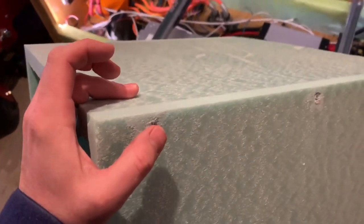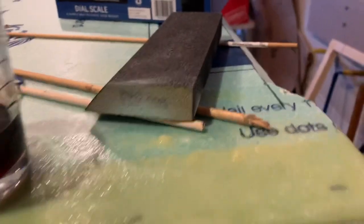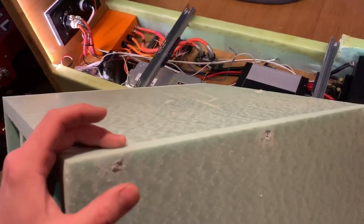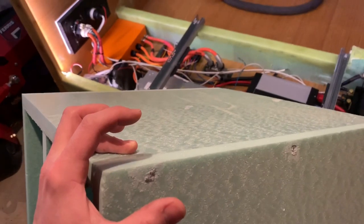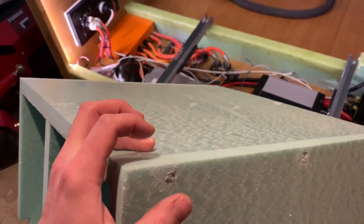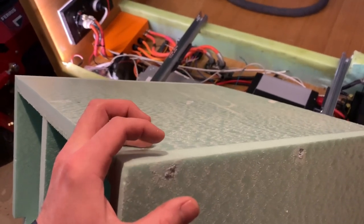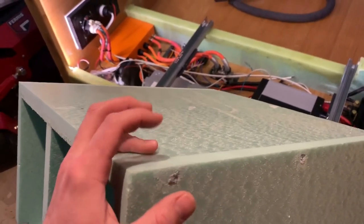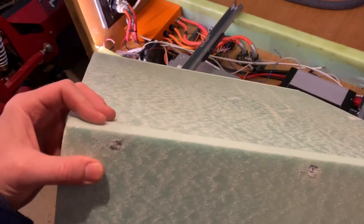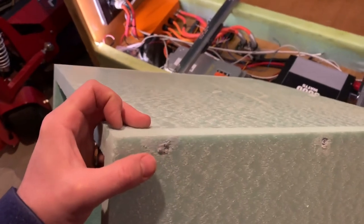The technique I've used - I take a drill bit and a quarter inch dowel, drill a hole about three inches deep, then slide the dowel in along with either a special foam caulk from Home Depot or Gorilla Glue in a caulk tube, squirt that in and slide in the dowel. It's worked really well.